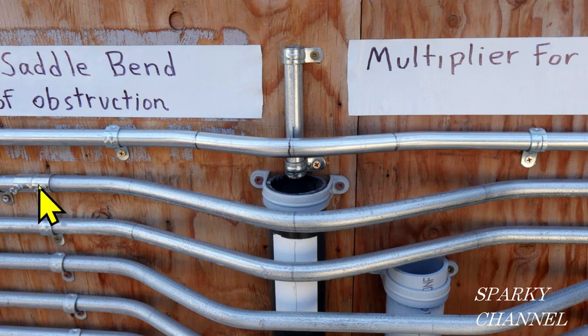In this case it started right here. You measure over and put your mark, then you've got to add on the shrink. That's how you get the center line, because the conduit effectively shrinks when you bend it — it doesn't appear to be as long. In this case the fitting goes 25 inches and I added on the shrink, which happened to be one eighth of an inch. And then the second question is about the distance from your center line to these outer marks.